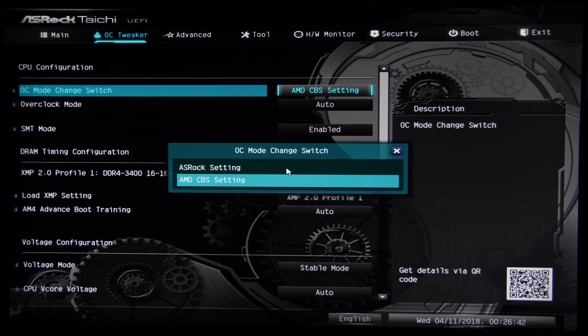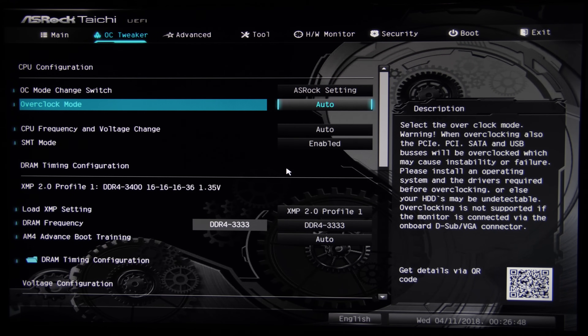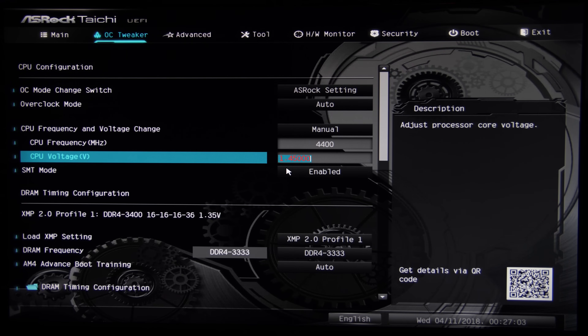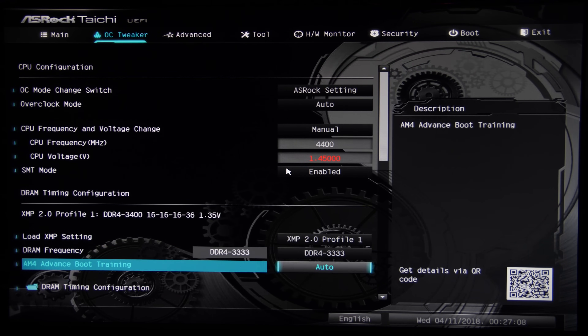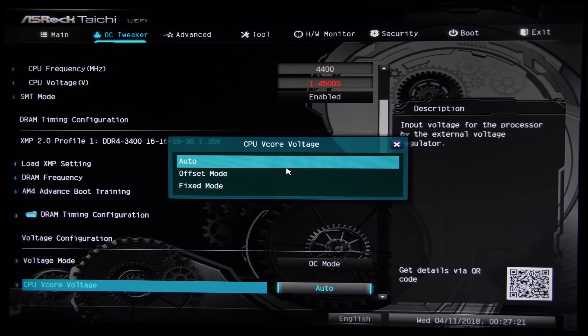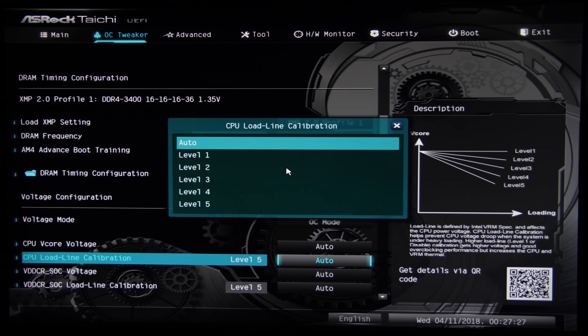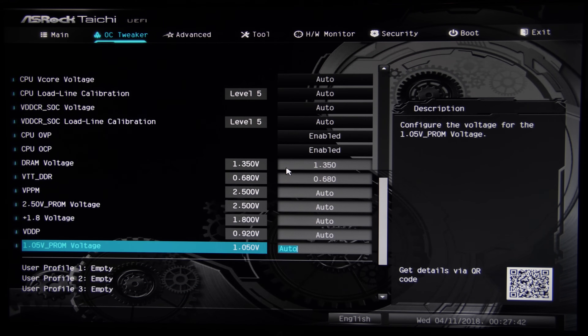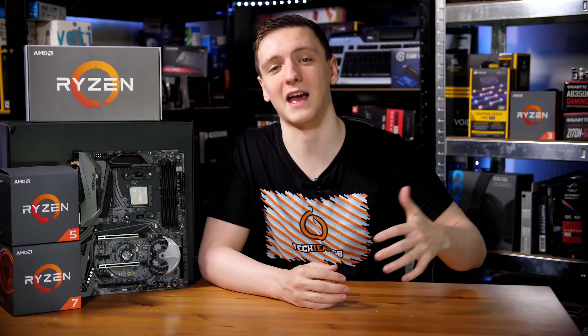It's well laid out with a lot of options available. When it comes to overclocking, both the 2700 and the 2600X didn't seem to overclock much if at all — I was only really able to leave them with their boost clocks, which went up to 4.3 GHz, and the board handled it perfectly fine. The VRM temperatures were pretty reasonable in the 50–60 degrees area. So if you did manage to get a chip that can be pushed a little further, I think you'd be pretty happy with how well the board handles it.